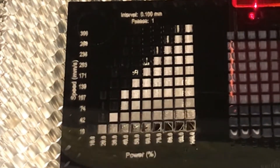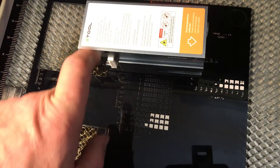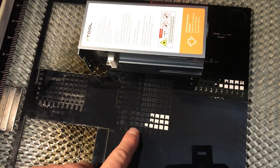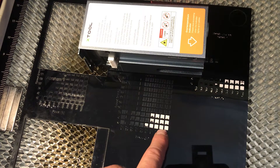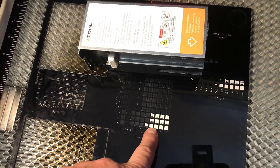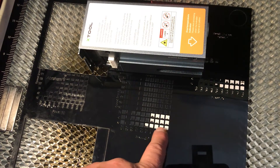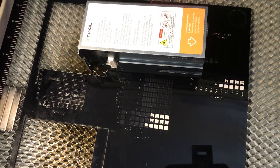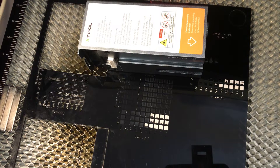The white engraving is not all that bright — it's kind of a chalky look. This is the test pattern for the IR 2-watt laser, and it's pretty cool that at certain power settings — high power and very slow speeds — it actually turns the black acrylic a really nice white color, so this is preferred. Unfortunately it doesn't have enough power to cut the black acrylic.